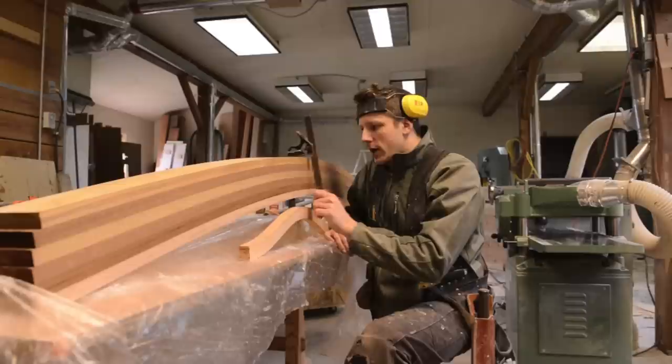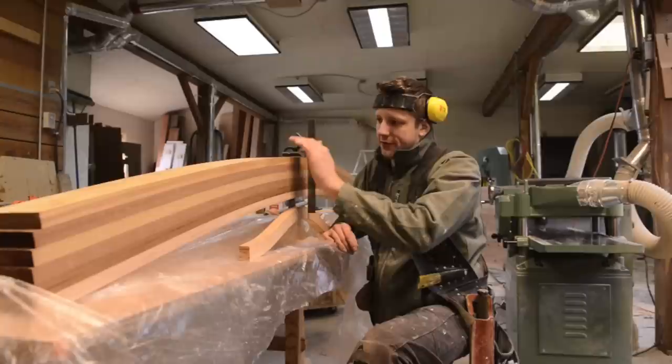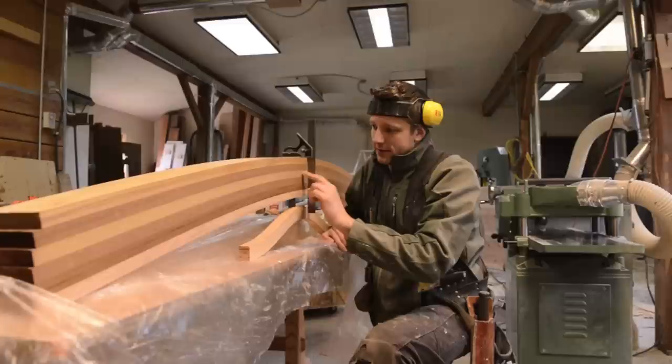She's all squared up. It's the way I like it. My little theory about getting flats on wood so that all the edge grain looks like it's the same piece of wood, and when it's laminated, it looks like a real beam and not a laminated beam.